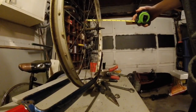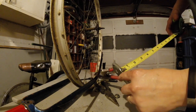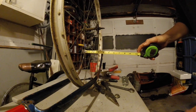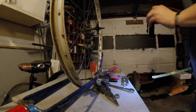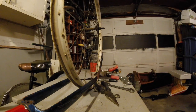We're going to measure this portion here, and it's about 3 eighths. So 4 and 3 eighths needs to be the width, because this is going to go inside that. So I'm going to measure that in — that's the width my fork out here needs to be. We get about just shy of 4 inches, so each of those needs to come out probably almost a quarter of an inch. We just need to do it evenly on each side, then we should be able to drop these in, weld those on, and the basic frame of the kick bike will be done.